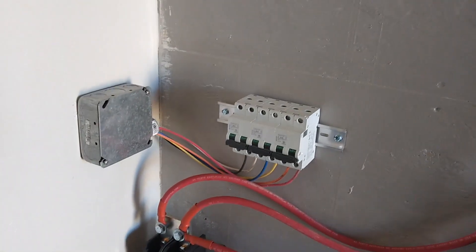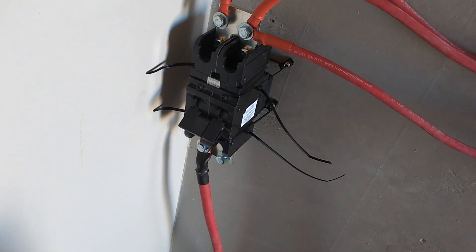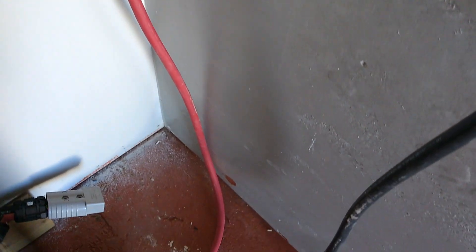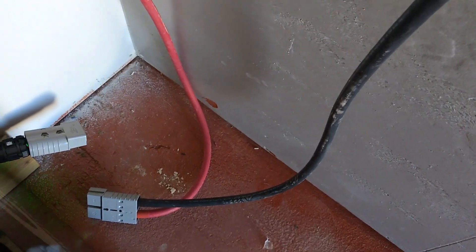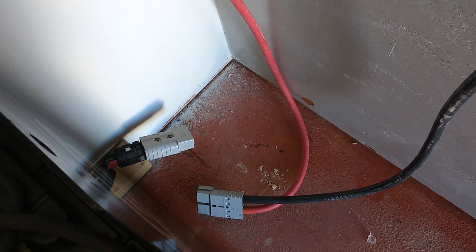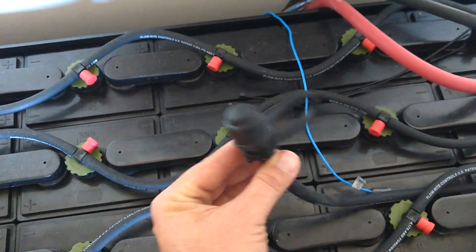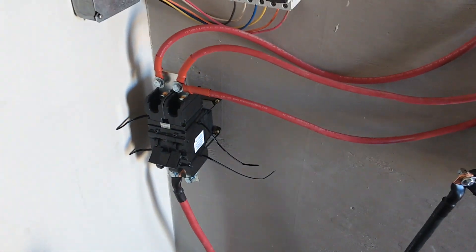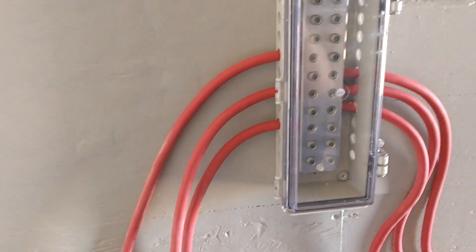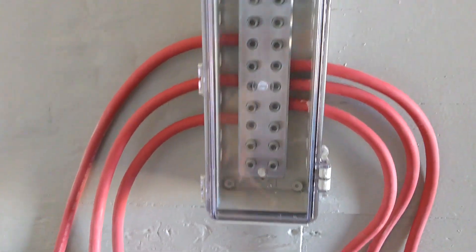Inside we've got those breakers you've already seen, and the rest of this stuff is all new. Unfortunately I wasn't able to find a nice mounting bracket for the big-ass breaker, so it's held up by wire ties right now. Going down here, we've got 4/0 cable going into that 350-amp connector. That pulsing green light is telling us that the water level is good in our battery — right here is the sensor for that, and right here is where we fill water into the battery. We've got 4/0 coming up to there, and then three 2-gauge wires coming off of that over into our terminal block, with a nice little cover over it so we can't short things out.